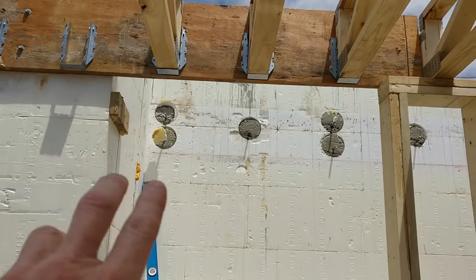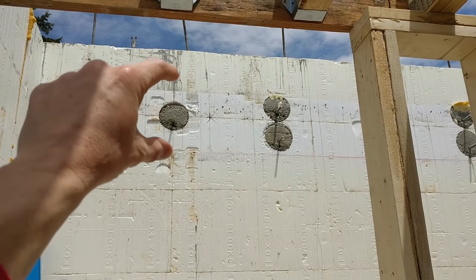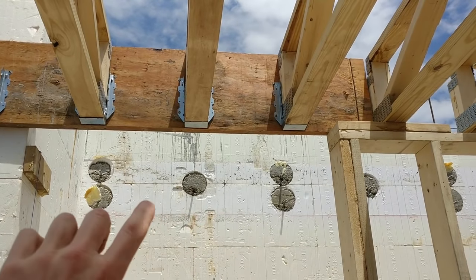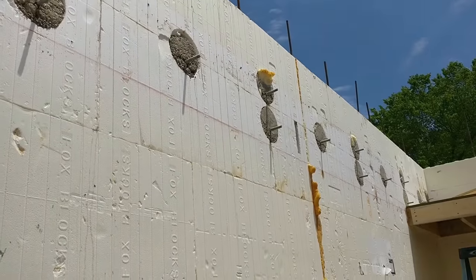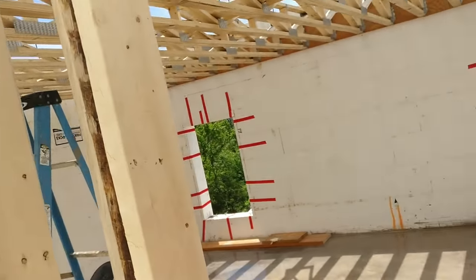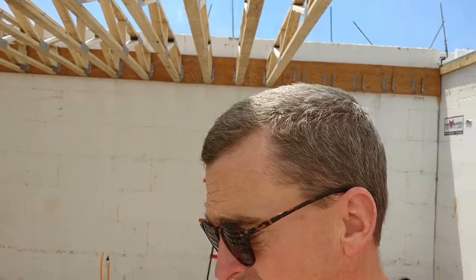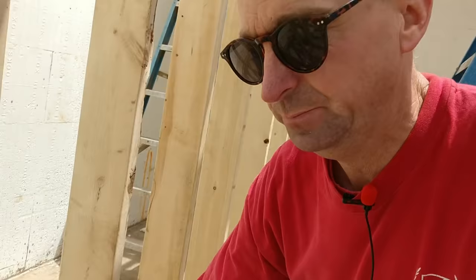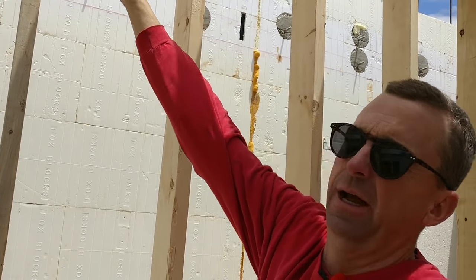This section that was right here is actually going to be placed right here because of our stair opening. We don't quite exactly know where our head height is going to be over in this area, so we'll pull that loose and use some of it. Once we figure out exactly how much head height, we'll put that piece on and be able to frame over it. That will be a vanity upstairs in what's a powder room, and the plumbing for that will actually be going to this pipe right here, going up into the floor joist where we'll connect to all the plumbing.